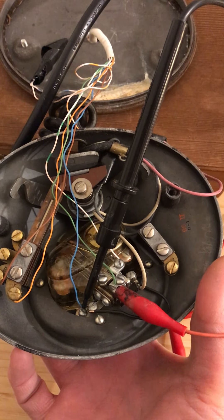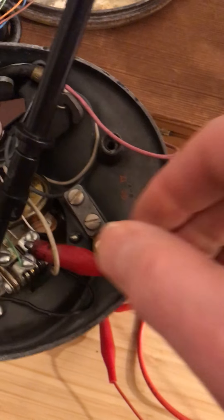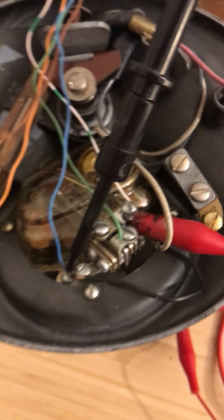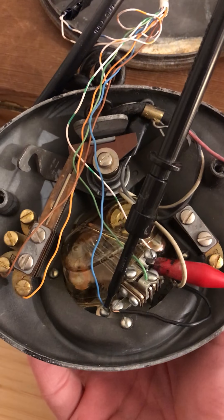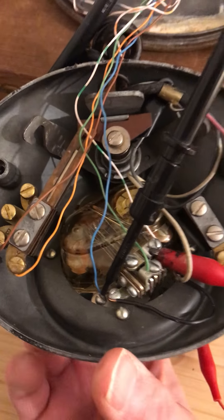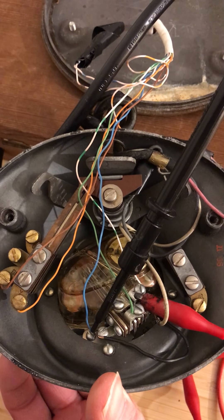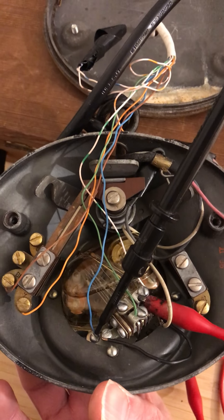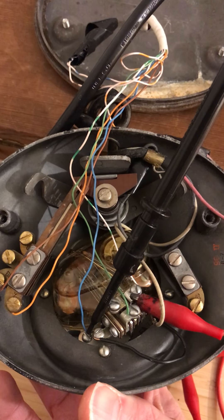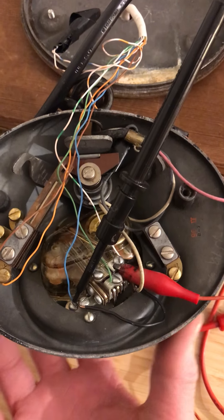Now there's another mechanism. Over here, this is normally connected. You want to know when to count the pulses and when not to. As soon as I start moving the dial it disconnects — it's not connected right now. I rotate it back, counting the pulses, and when it's done and back to the home position it's connected again.